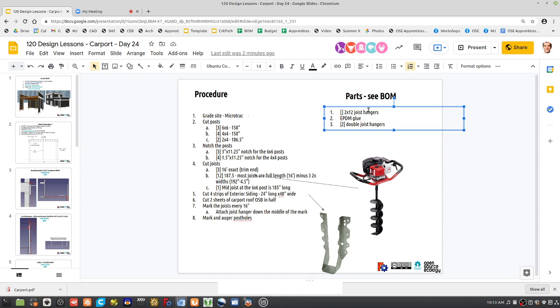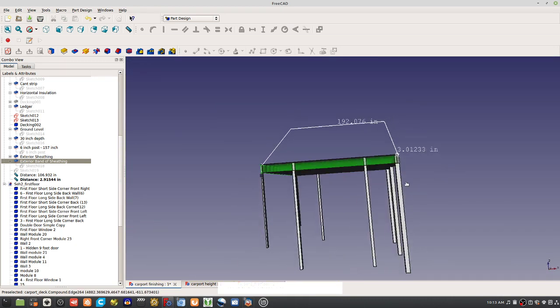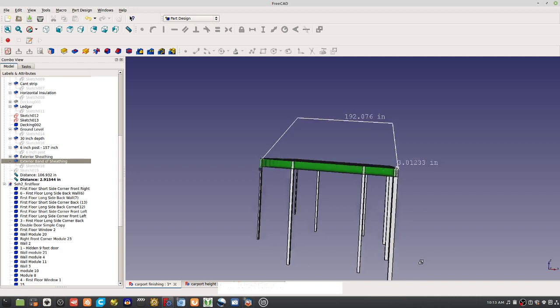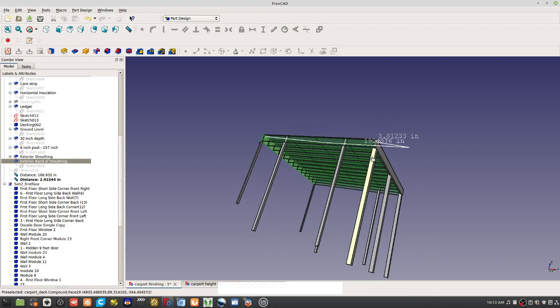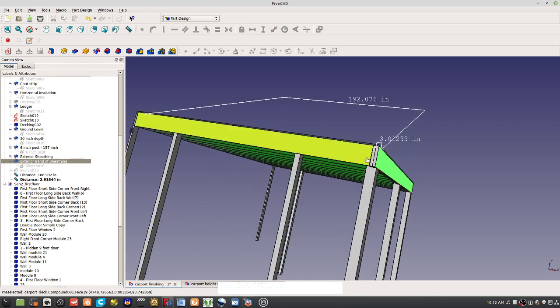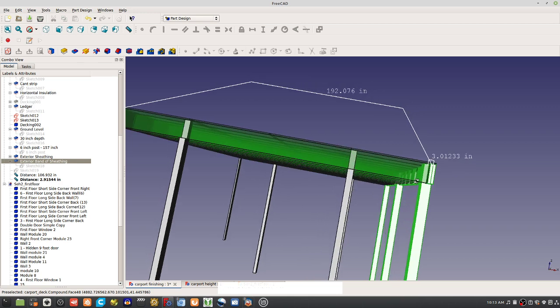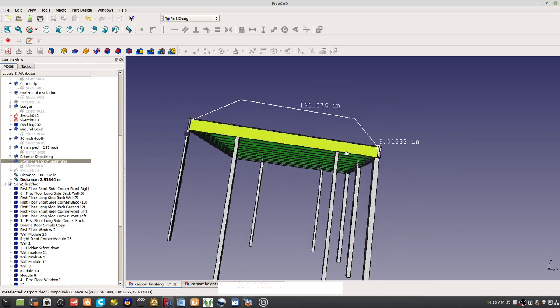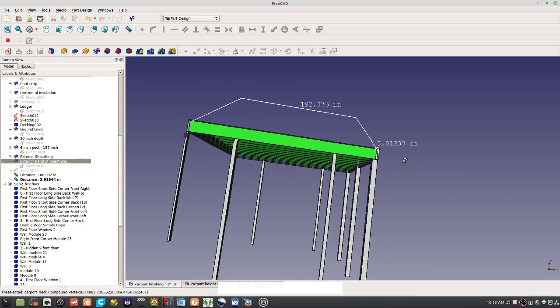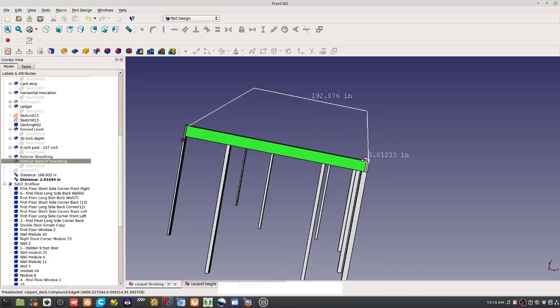So the procedure is when we're on site there, what's the overall flow? In fact, the most ideal way to do it is do all the holes at once so that we've got them all dug. But put in the three large stakes into the holes, and put these beams here. And then if we insert at least one of the joists, then you'll know exactly where the correct location of the top of the post will be.